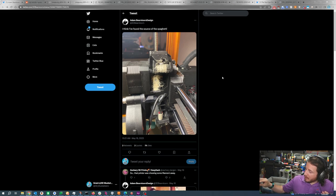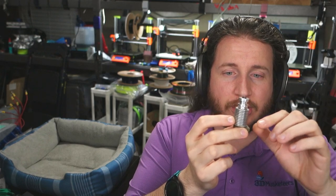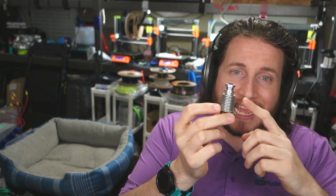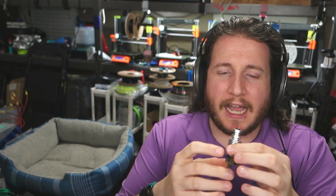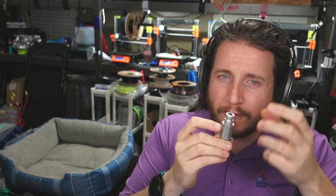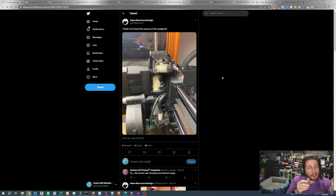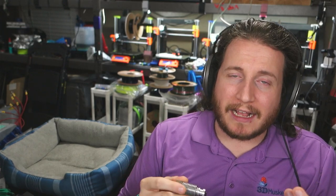Once those hobbed gears get a little bit caked up or get a little bit of stuff in there, it is very easy for them to continue that process of shaving off just a little bit of filament. This can also be caused from excess back pressure and gunk inside of the hot end on a Prusa. Prusas use an E3D V6 and it does have a little piece of PTFE coming out of the top traditionally — that PTFE does not go down into the block, so this is still an all metal hot end. If that PTFE is damaged and creating too much friction, that extra back pressure could cause the same issue, as could a partial clog in the nozzle causing the extruder to skip.